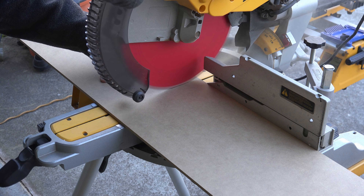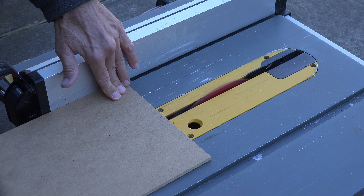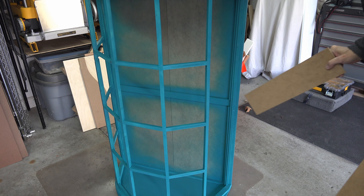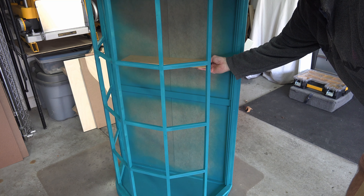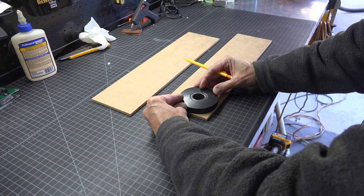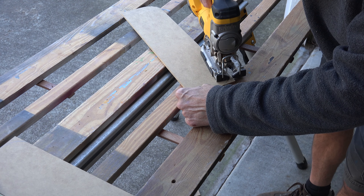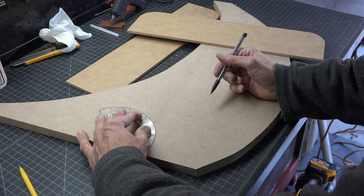While that was drying, I took a leftover piece from the back plate and cut it in half. This would be the shelves that the requester wanted in the back of the box. I decided on 18-inch shelves across the back. Her only stipulation was that she wanted 18 inches between both shelves for a special object she intended to place on the lower shelf. Taking the piece to the table saw and ripping it in half, I would end up with each shelf being a little less than five inches wide. If you're making this window yourself, you'll probably bypass making these shelves, so I'll speed through this process.